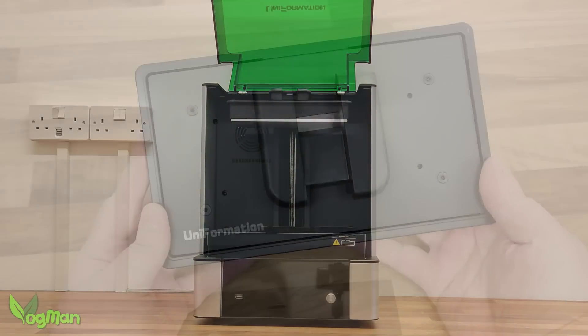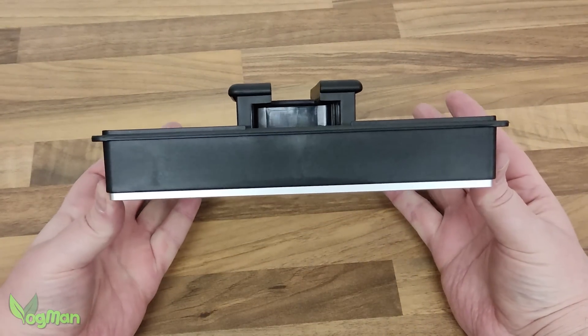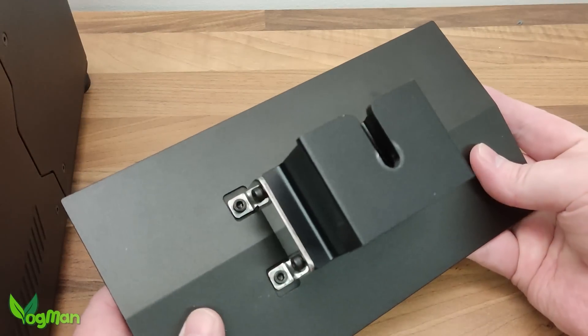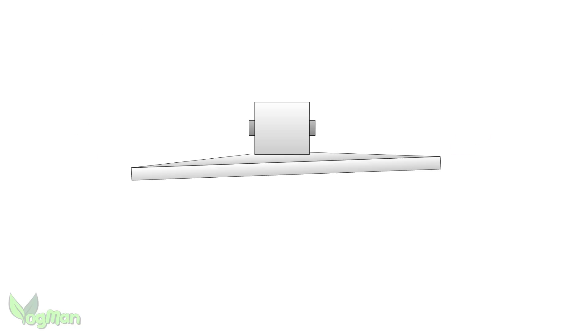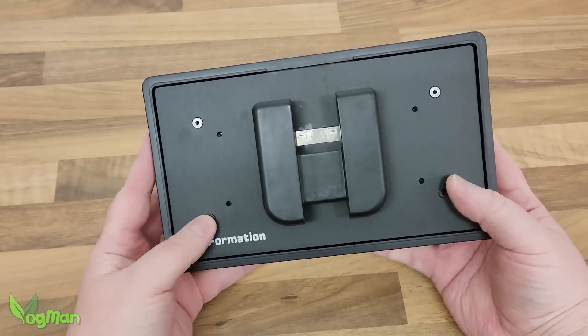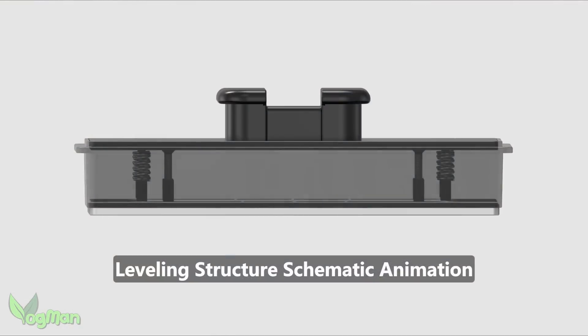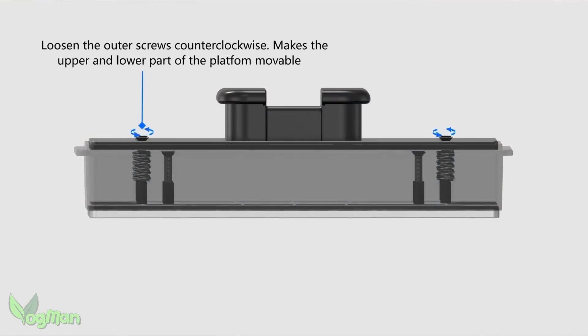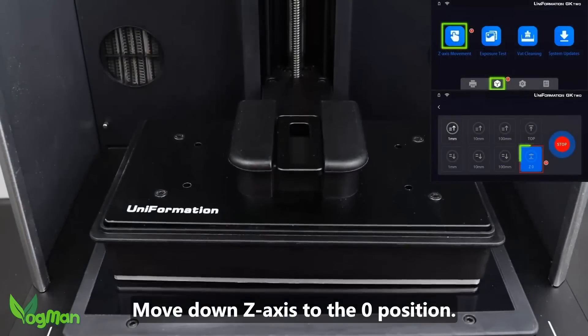Now things look a little unusual — this is the build plate. There's a lot of plastic around the top, but that's to keep your fingers out of the mechanisms inside. Build plates are pretty much the same: a wide flat chunk of metal screwed into a central hub. The problem is, thanks to the laws of fulcrums and levers, the tiniest bit of movement here makes a massive difference here. But Uniformation has placed its adjustment screws at the ends of the plate, poking a finger in the eye of the fulcrum laws. These plates come pre-leveled, but always check just in case. I deliberately messed with mine just to experience the levelling process — it was different, I'll admit, but it's well covered within the included tutorial videos. And in minutes I'd got a perfectly levelled plate.